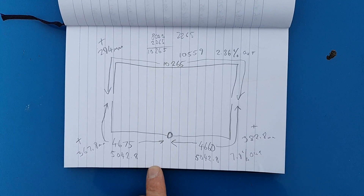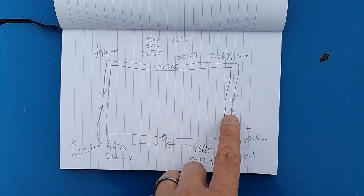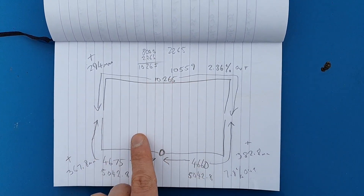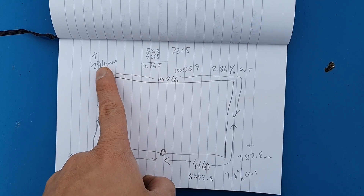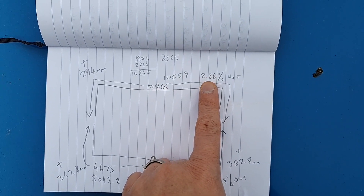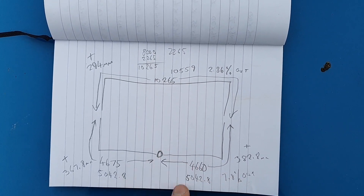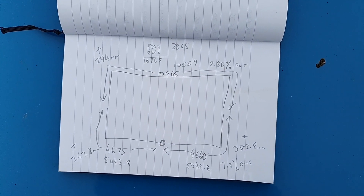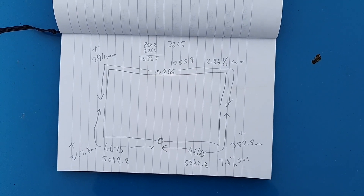So what I'm going to do now is go have a cup of coffee, get my head together, and then I'm going to add wire at the feed point sides and add wire on the reflector as well. I need to add it on both sides to even it out. Fingers crossed I've sussed out what's going wrong — once I get it back together I'll need to double and triple check the links and then we'll get it back in the air.